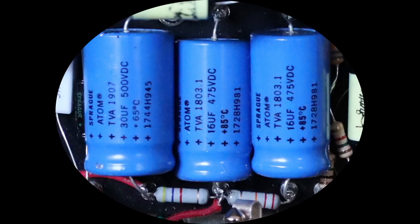So I wondered if I should try it with a fresh set of filter capacitors. The electrolytic filter capacitors would seem unimportant other than keeping the power supply clean, but they do directly affect the tone and response of the amp. They also wear out and need replacing every 10 to 20 years, so clearly they change relatively quickly. So I built a brand new 5E3 circuit tweed deluxe style amp - everything brand new, new chassis, new sockets, new knobs, new valves - and the first audio that played through it is the zero hours you're about to hear, apart from a bit of hum and hiss when I was checking the bias. After 48 hours, no change still.